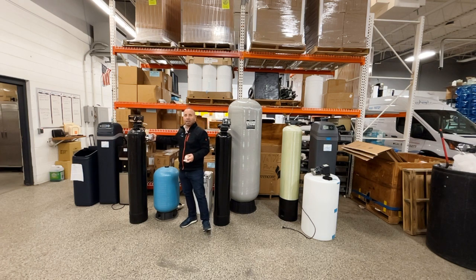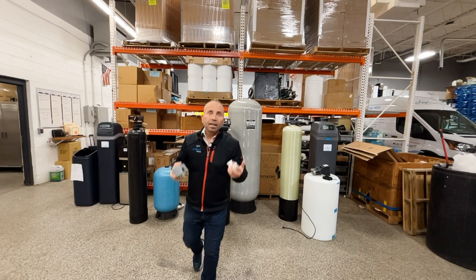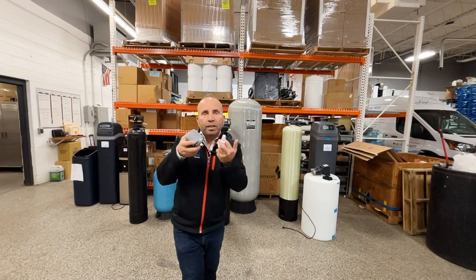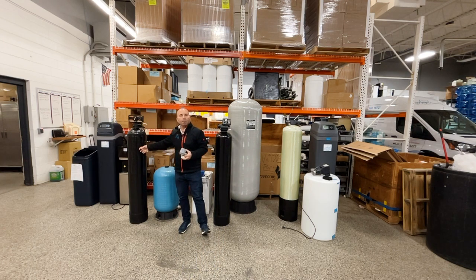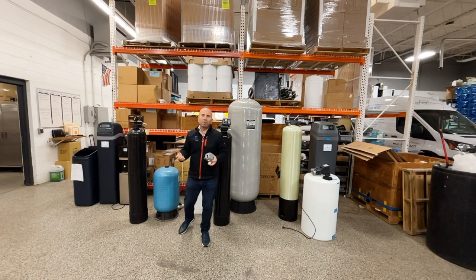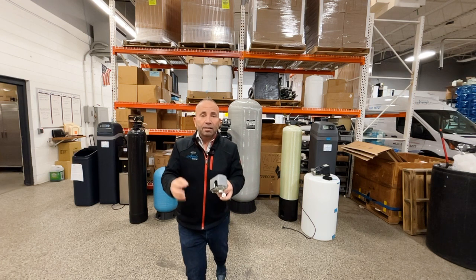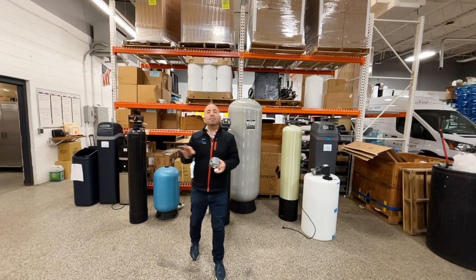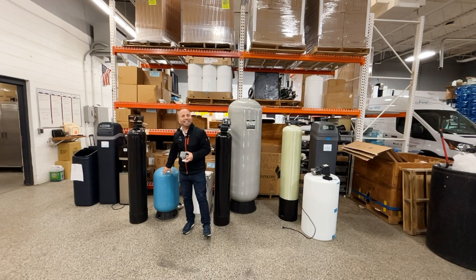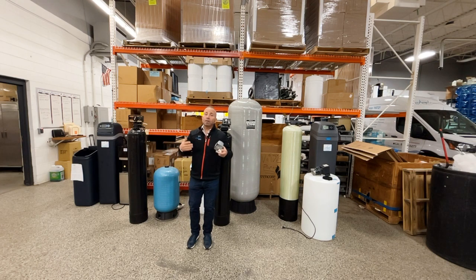That's actually why we wanted to run the water into a carbon filter to take out that excess chlorine. But buyer beware. If you're watering the lawn, it's always chlorinating and you get way too much chlorine and it ruins the carbon filter material in there. So you got to remember that. That's why it's just a really, really bad design. In fact, in Illinois, the Department of Public Health has outlawed that design. You cannot inject anything before the pressure tank because it is an inaccurate way of dosing it. Now, the products are still sold online, so we want to make sure you're aware of them.